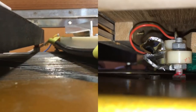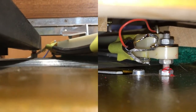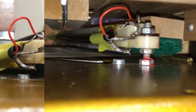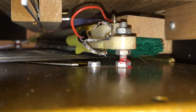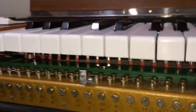The strings were so low they were practically touching the harp, and that was creating a lot of the buzz. We also had strings making contact with the lower pickup, causing a pop. The strings were also much too far away from the upper pickup, so the upper pickup wasn't dead — it's just that it was too far away from the strings. Every millimeter really counts. You can see those nuts there are for adjusting the pickup height, so it's very sensitive, and the strings being too far away meant we weren't getting any signal from that pickup at all.